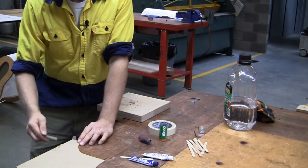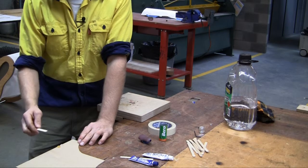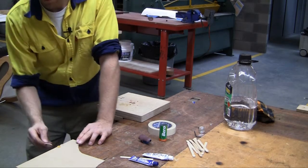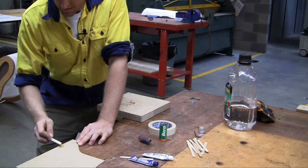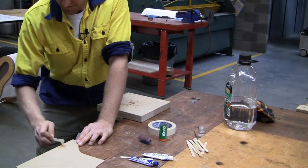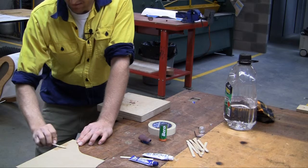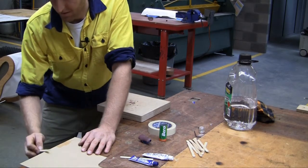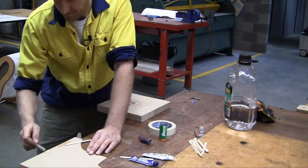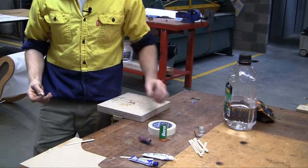With your paddle pop stick, come in straight and fold the mixture in. Once I've mixed it all together I scrape the whole lot off, put it on the board, wipe it and have another mix. What that does is if there's any residue of A or B left, we've left it here and we've got the full mixture just here. Just scrape it through, wipe, and give it another go. Now take the whole mixture, wipe it on the stick and come across to a clean piece of board, then get a clean stick and just mix it again.